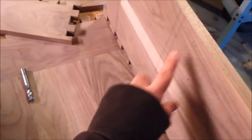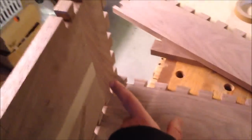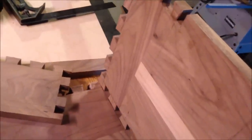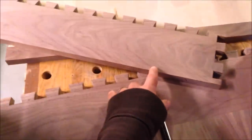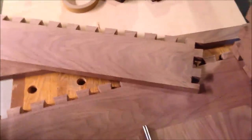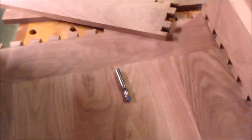I've got the back with the sides here, and what I'm doing is transposing the lines I had when it was all assembled, making sure everything lines up on both sides. I've also got the top one that's going to go on the sides — that's to cut the recess for the plywood. I also made sure it was marked on the head piece. I'm going to use a half-inch up-cut down-cut spiral bit on my router, and my layout is all done for those — I'm going to get set up with the router and cut those now.